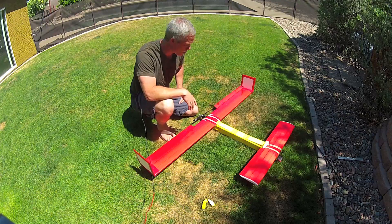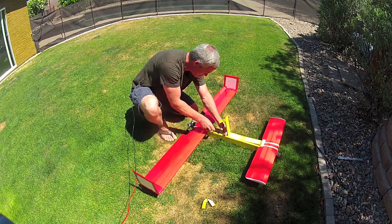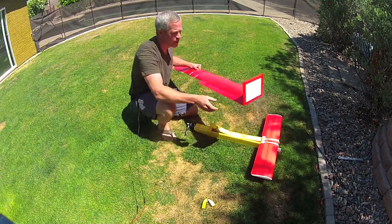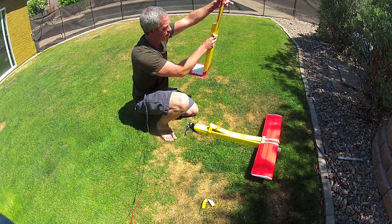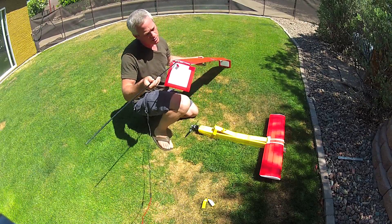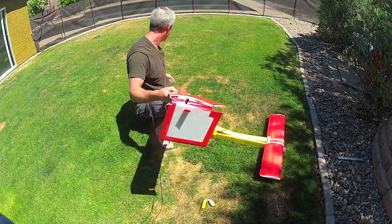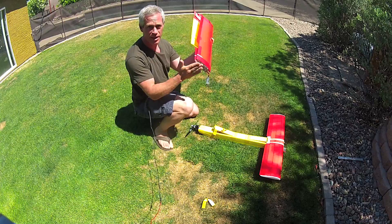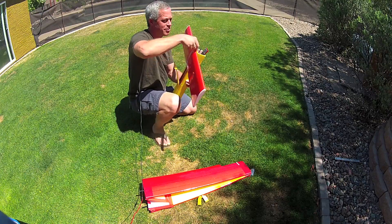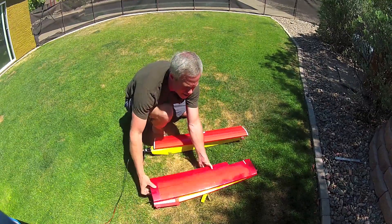So that it's ready to fly. The breakdown goes like this: the hatch is opened, rubber bands are removed and stowed, the receiver is disconnected, the wing is dismounted, and the vertical stabilizers are collapsed. The pusher is used to push the spar out into the central position so that it breaks cleanly right there. There's the main wing collapsed. Then the canard rubber bands are removed, the canard comes off, and everything's nested nicely together like that.